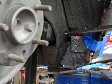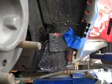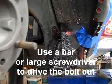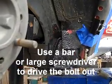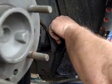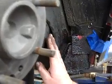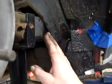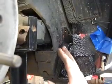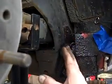You can see this bar here — I'm going to try and drive that bolt out. And it's started to come out. So that's probably one out of ten that are that easy. Most of these Midwest cars are rusted and you actually have to get in here with a Sawzall and saw right through the shims and the bolt on both sides. It probably takes 20 minutes to do that.